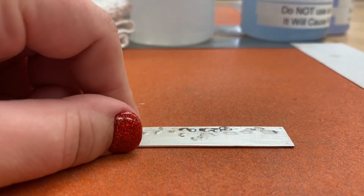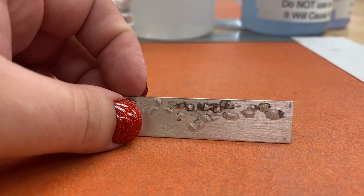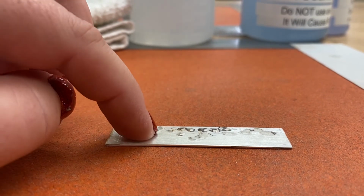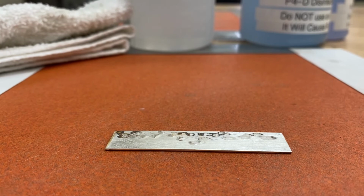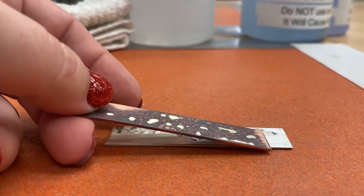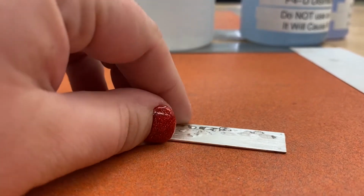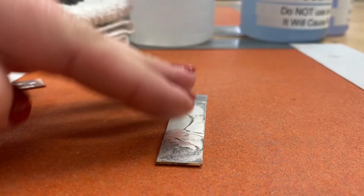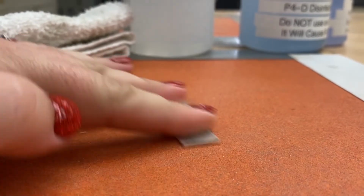After flowing my solder across the back, it looks like this. You can see it's pretty bumpy. It's got some relatively high points. And so I need to sand it so that it looks like this. See how that's a lot flatter, the solder portions are? So this is a sanding board. It's just some sandpaper. It's as easy as it seems. You turn it over, and you just sand it.